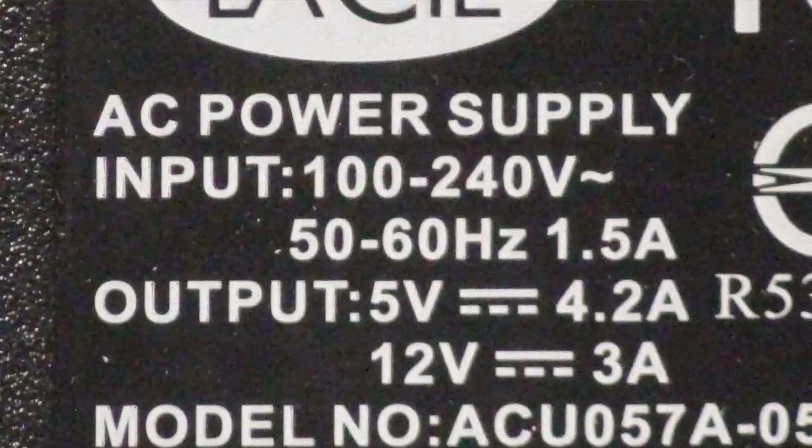But I'm sure many of you are wondering what kind of power supply I used. Most of the computer fans run on 12 volts DC. And I actually had a spare power supply from an old computer or laptop or something like that, and I'll show that to you as well. But most of those power supplies will have either a 5 volt and a 12 volt. These fans will actually run on 5 volts DC. They just run at a slower rate. So my thought was that we could use both the 5 and the 12 volt DC output and have basically a high and a low power setting. And I'll show you how I wired to set that up. It's actually pretty easy, but rather than doing this step by step, I'll just show you what I did. So that's the skinny.